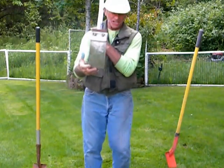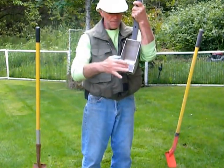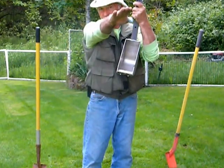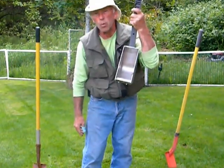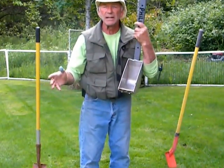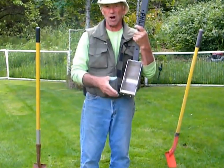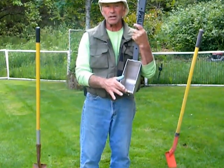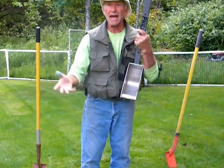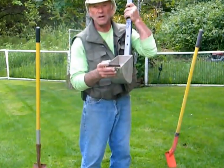Let me talk about those other applications. This is the cleaner blade. You want that trench smooth, you want it level — this is it. For drainage, start at the low end, work to the high end, get your level. Everybody's happy and it's quick. Nobody does time-and-material anymore — it's always one cost for the job, and you've got to make that cost. This is faster, more efficient, less time wasted, and your employees will like you better. They're not bending at the waist pulling debris out. This blade is called the cleaner.